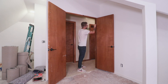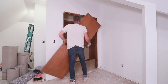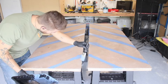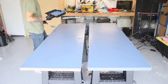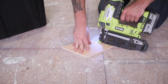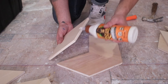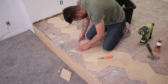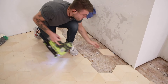These flat panel doors aren't exactly ugly — if I would have just painted them and replaced the hardware, they would have looked great. But I thought if I'm already going through the work of painting these doors, I should add some sort of texture or pattern. I made a whole separate video on that process, linked in the description. You'll also find a link for the flooring video. The coolest project I've done in quite a while: I got half inch birch plywood and cut it into parallelograms. Because I made all four sides proportional, they assembled to create a repeating, seamless hexagon pattern that looked amazing. There's a link for that project in the description too.